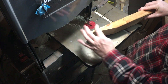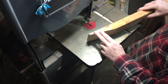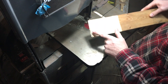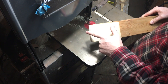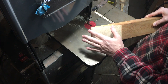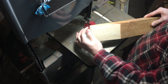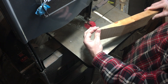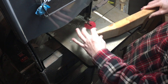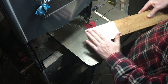As you do that, your knife gets thicker and you start losing cutting performance. One way you can combat that a little bit is this shoulder here where the secondary bevel meets the primary grind — you can knock that shoulder down a little bit and thus keep it a little bit thinner. But that only works for so long until you really start getting thicker over time with use and sharpening.